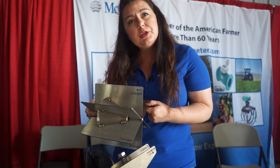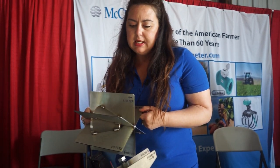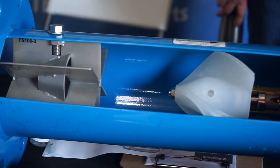These are space savers whenever you don't have a lot of upstream, downstream pipe run. And what this does is it cuts what diameters you need in about half. So instead of having a 10-to-2, you actually only need a 5-to-1.